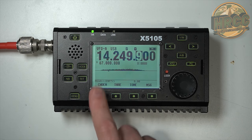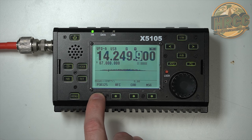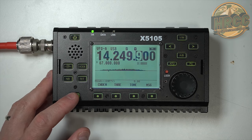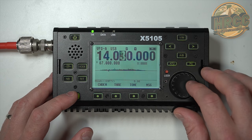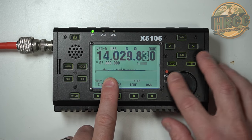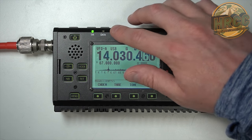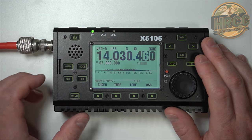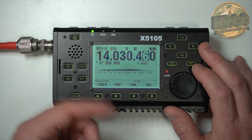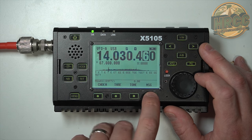Menu item five is where you get into the digital setting, and that's where you get this readout. This allows you to change between things like RTTY, PSK31, PSK125, and CW. I'm doing CW decode right now — I was testing this out on the contest. It gives you these really nice easy-to-read displays so you can get right up on the station that you hear. It is effective in that it will show you when you're zero-beating the station — it starts to flash the data light when you're zero-beating. Threshold is how high the signal must be before it starts trying to decode it. Tone is 800 Hz.